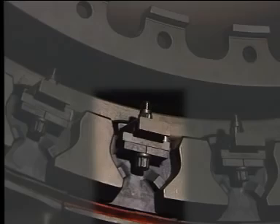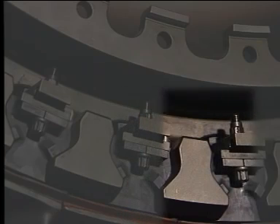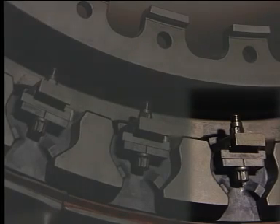Note: when you remove only one fan blade, it is necessary to remove the blade retainer, spacer and key from the adjacent blade. The removal of the blade retainer, spacer and key will permit enough blade movement to disengage the mid-span shroud.